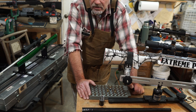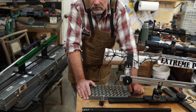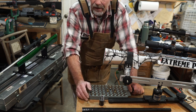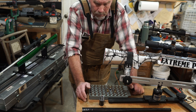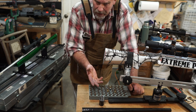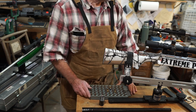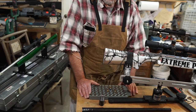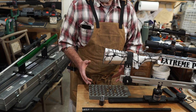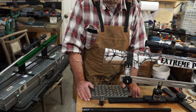And he just threw the question out, hey, who's done this with the 6PPC? I haven't. Well, now we're going to. I'm going to make a 6PPC fire form barrel in a 7.5 to 8 or an 8 to 7.5 twist. We're probably not going to bore you with any more fire forming stuff, but I might show you how we're going to do this. Load some 22 bullets with a hot load. Well, we'll find a load. 22 bullets, that's the key. And rattle them down that 6mm barrel, blow this thing out, harden the neck, slap her on the mandrel, turn it to size, bada bing, bada boom.